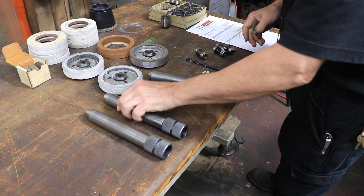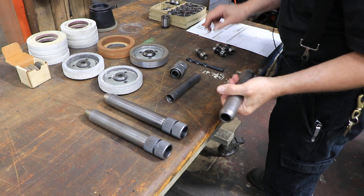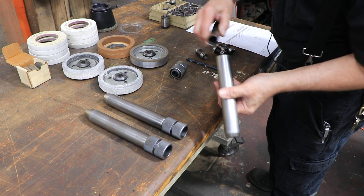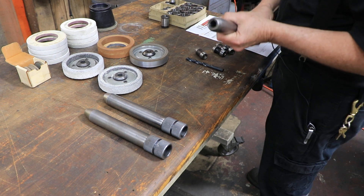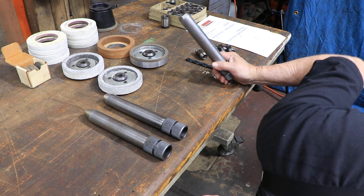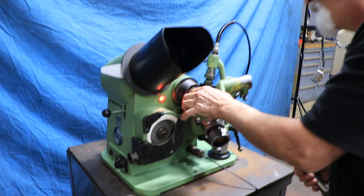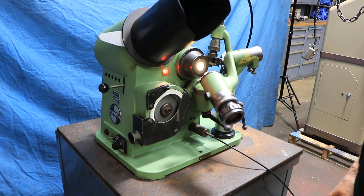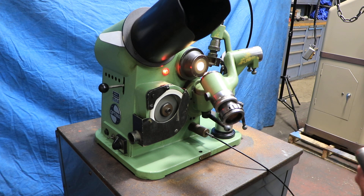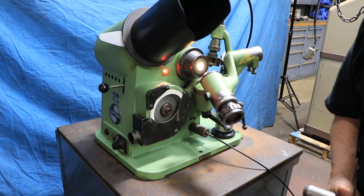That's the larger chuck, what's called a chuck tool holder. Then you have this one that comes apart — has a bar in there — and your different collets that you drop inside. There's a taper that lines up with the other taper on the collet. Each one is made for a specific letter drill, number drill, or fractional drill, and then it goes in this holder. There's a company out in Butler, Pennsylvania called Johnson's Tooling — they're very helpful with these machines, have all the parts and service. Give them a call, and we appreciate you watching our video. Thank you very much.